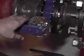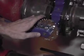As for maintenance, typically, if it started to fill with like a sludge and we're getting a serious pressure drop, then we would need to pull it apart. There is a sequence to pull it apart. There are some extra gaskets that will be in the attic stock for these heat exchangers. If you needed to isolate it, we've got isolation valves where it enters and exits from the heat exchanger.